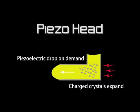The different types of head technology that use these inks vary between manufacturers. Some of them are using a piezo crystal. A piezo crystal is when they put electricity on it, it vibrates, and the vibration is connected to a mechanical pump that's squirting ink out of a barrel, similar to ink coming out of a shotgun.